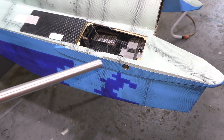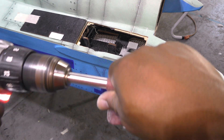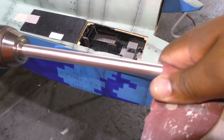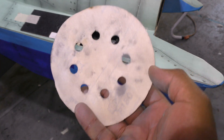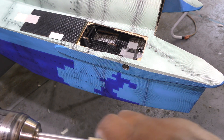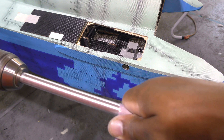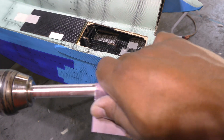I've voiced my concern about how much I dislike this, but I can't get the rods to go through, so what I'm doing is mounting them on a drill and basically evenly grinding down the metal so that it fits better into the receiving bushing. I'm using 180 grit sandpaper, and once that's done I'm going to work my way up — 180, then 320 — because I want this to be smooth, then maybe stop at 800 or so. That's what I'm going to have to do to get this rod to fit perfectly in there, but they really should find a better solution.